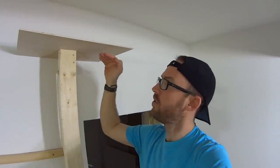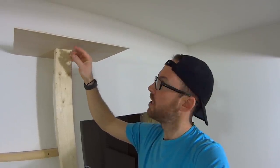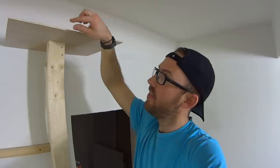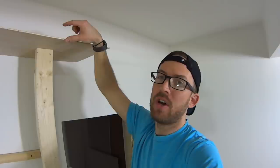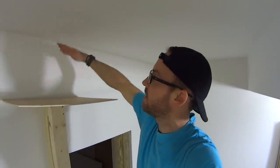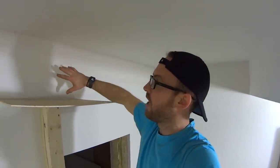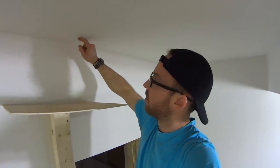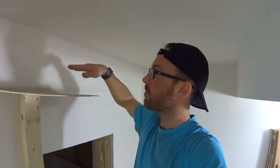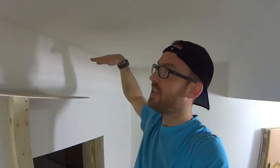This ledge is kind of like an open soffit. At each one of these uprights I want to have white down lighting — the main bright light in the studio for general white light. The soffit will be maybe two to three inches thick. It will also hide the 16-color LEDs for up lighting. On top of that, it creates a space of about 16 inches where I can add another bass trap if needed, because this is a corner and there's a good possibility I'll need bass trapping up here. I'll also have acoustic panels coming down at an angle for ceiling absorption, and the soffit is positioned so it won't interfere with those panels.